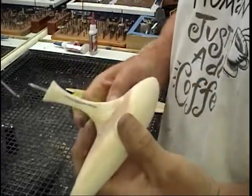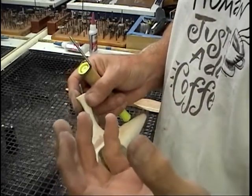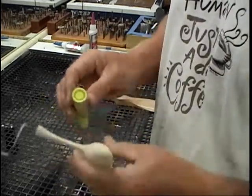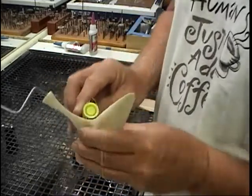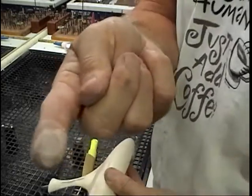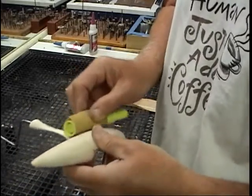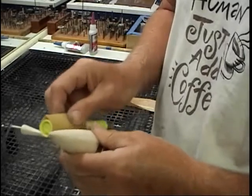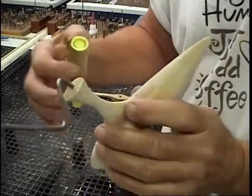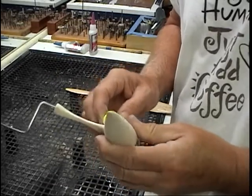Now, we're back to working on the wheel pants for a little while. It's always good, any aeropoxy light, actually any two-part thing, should be cured in 24 hours. If you let it sit, especially out in some heat, you take your little dowel with some sandpaper, and it comes off like powder. If it doesn't come off like powder, one of several things can be wrong. You didn't mix part A and part B, each in their separate tube. Then when you mix the two parts together, they have to be measured accurately. All the directions are on the label, of course.